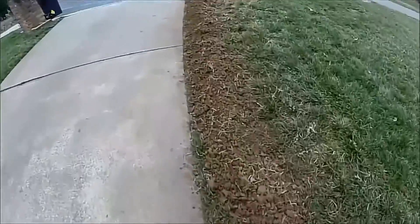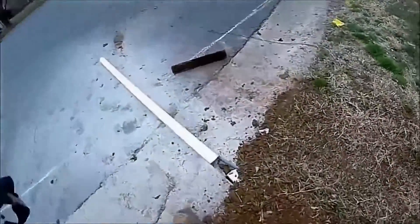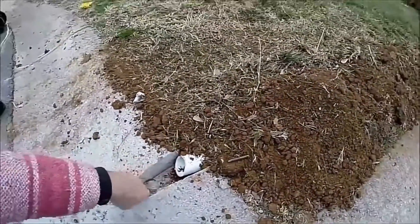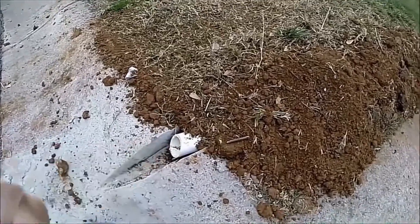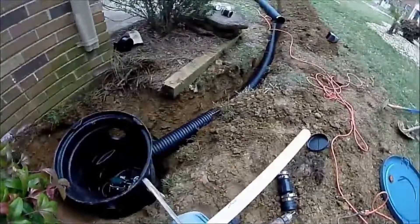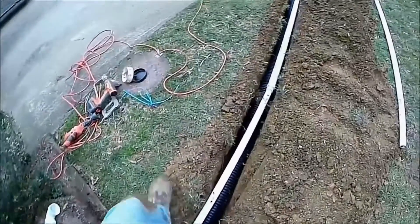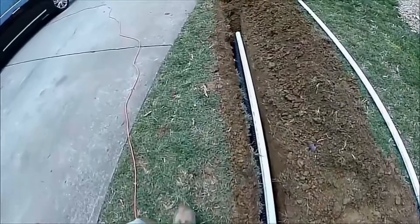Using a good sump pump, we easily lifted this water up and sent it all the way out to the street — because it was uphill from the garage to the street. So once again, two parts of every system: collection and discharge. There's the sump pump line where we cut the curb and brought it right out to the street. We collected the water with catch basins, sent it to the sump pump, and the sump pump lifts it up and sends it out to the street. I'll show you the sump pump setup on this job in the next video.